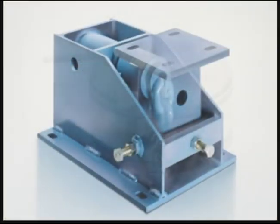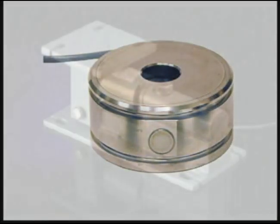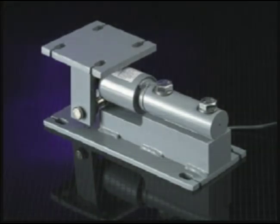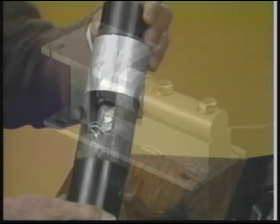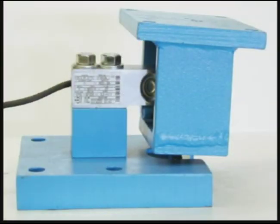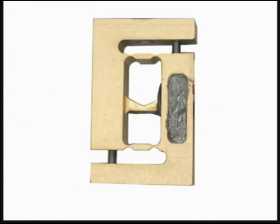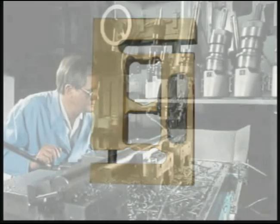There are many different styles of analog weight sensors. There are canister load cells, weigh bars, shear beam cells, single point load cells, and S cells or Z cells, which are named because of their shape.